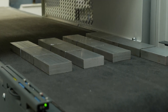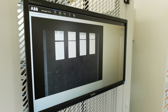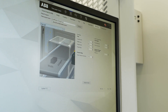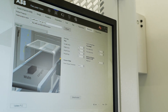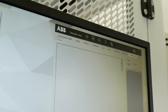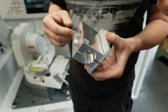I've never seen a computer vision system used to pick up parts - I guess it's quite a new technology. What parts does it apply itself to well and what kind of parts does it not? Picking up general billets, no problem - square, rectangle, round as well. We have had issues though with extrusions. A bit like your part here? Yeah, this part here was made from an extrusion, machined, five facers.